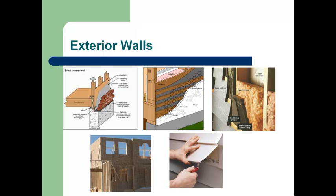If we're going with a stucco facing on a house, we'll need to be opening up that wall cavity on the inside again, making sure that we've got good airflow so that we're drying both the inside and outside of that stucco surface. The top right picture shows a wall with lap siding, and then we have a fiberboard sheeting, sometimes referred to as buffalo board. It will really require a little more investigation to determine whether that buffalo board is still intact. By opening the inside and removing the insulation, we now have airflow on both sides.